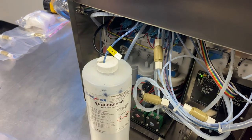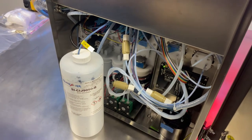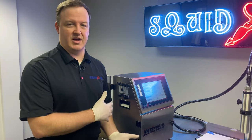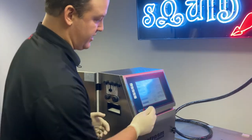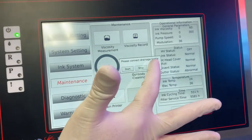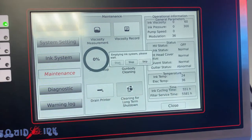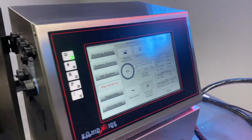Locate the drain pipe — every Jetstream will have that drain pipe labeled. You'll see a yellow tag that says 'ink drain pipe' on it. Locate the inline filter that pipe plugs into, and on the side of that filter where the tag is, disconnect the compression fitting. Once we disconnect this, put it into our waste collector so we can start draining the machine. Now head back to the front of the printer to the display. Now that our drain line is in a waste collector, come back to the display and click start. The printer is immediately going to start dumping the mix tank.